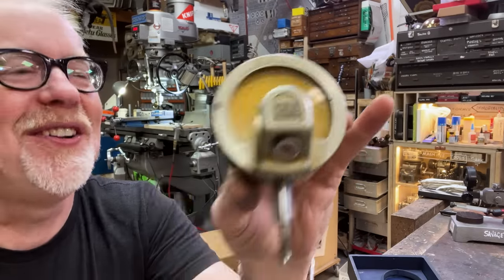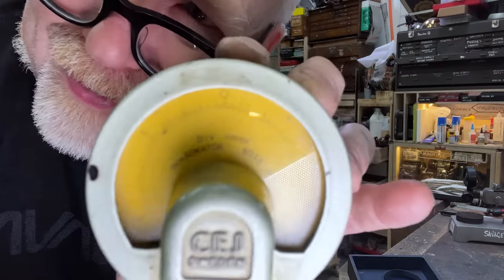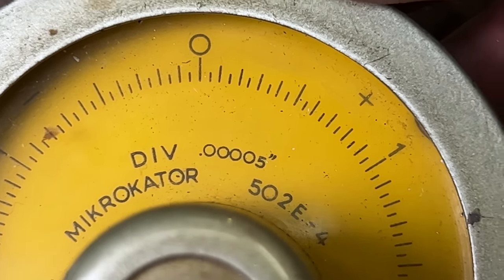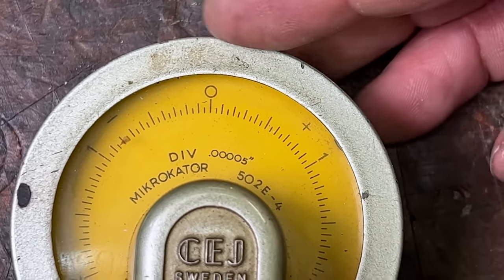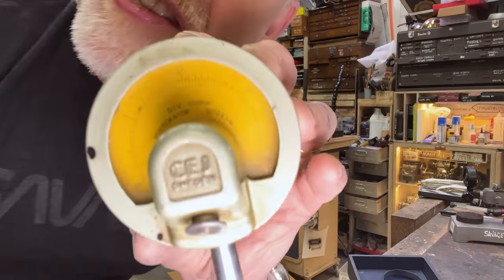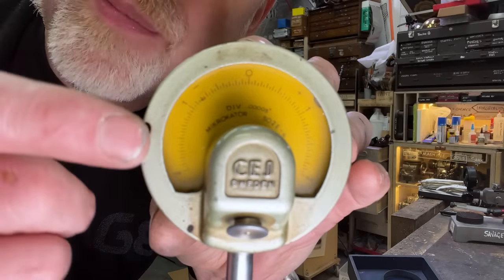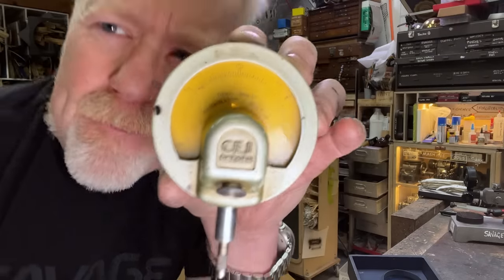The zero point is between here and here. That distance — which is just under an inch — is the measurement for one-thousandth of an inch. So this device measures a total of four-thousandths of an inch: two on this side of zero, two on that side. This gauge has 80 lines that all fall within the width of a human hair.